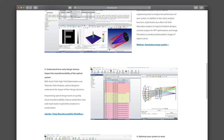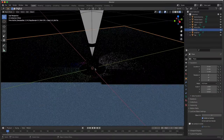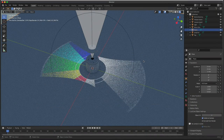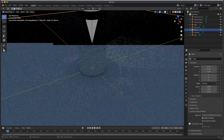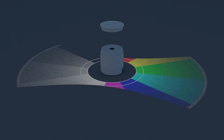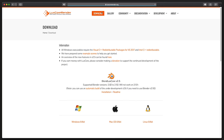But there is an alternative which is a bit more accessible: Blender! We can just ray trace the whole 3D model and get a pretty good feeling for the field of view or distortion we get with a certain geometry. This works both for simulated cameras as well as lights or projectors we want to bounce off the mirror. But before we can do that, we need to install LuxCore, a slightly more fancy rendering engine which handles ray tracing in both directions.